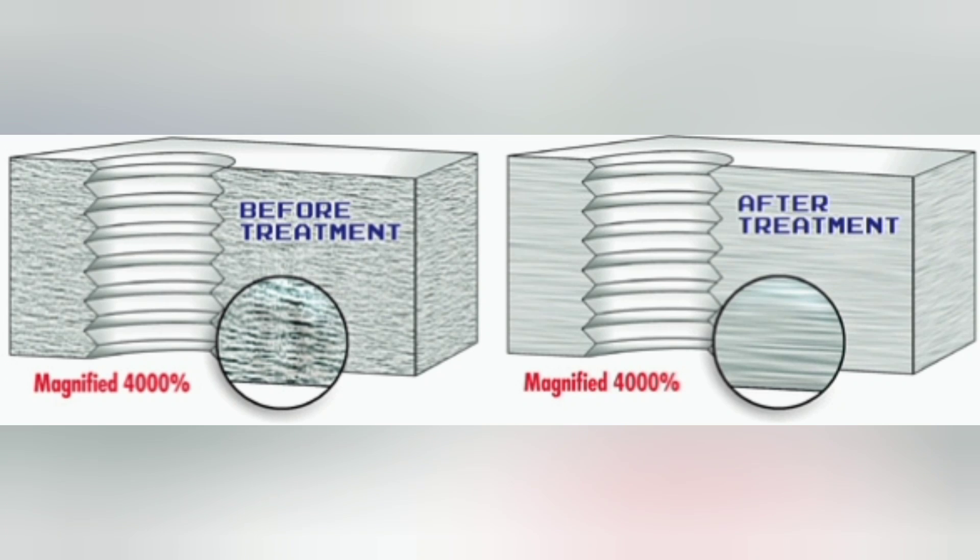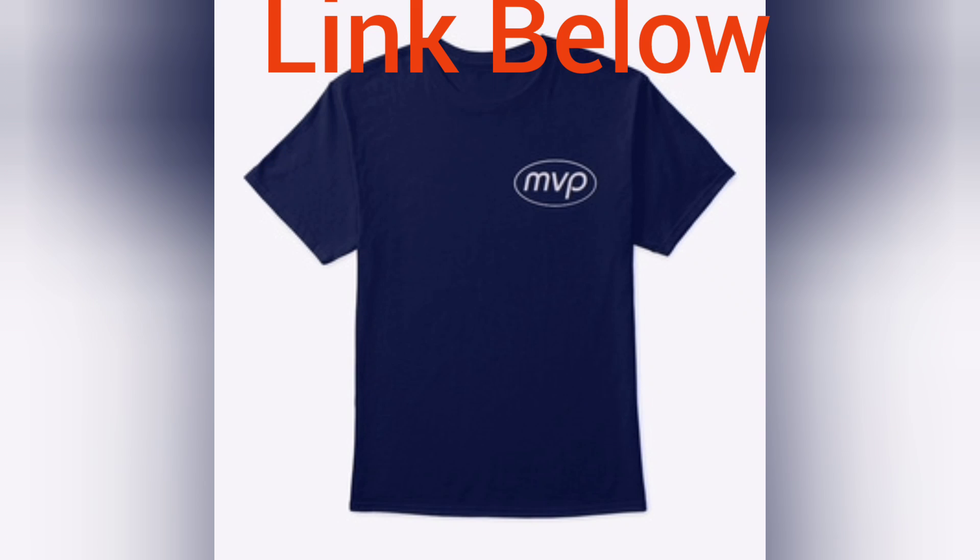The moral of the story is: use hot rolled, get it a little oversized, plan on squaring the outside of it — that's the inexpensive solution and much more reliable with no extra operations. Thank you guys for watching and we will see you in the next video. Please be sure to like, comment, and subscribe if you're not subscribed already. Also check out our t-shirts and hoodies — if you wind up buying any of those it does help us out a little bit.